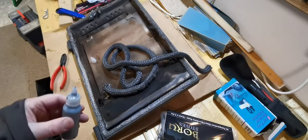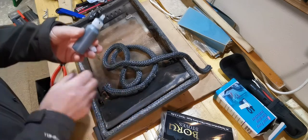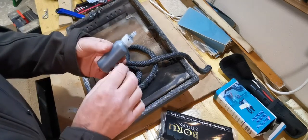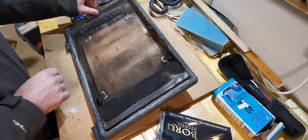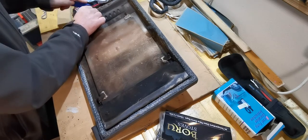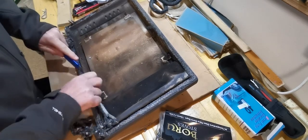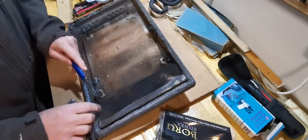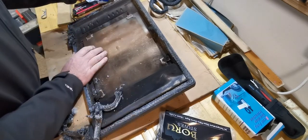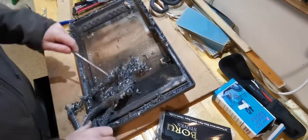Just to say - I opened this glue up, took the top off with the snips there and gave it a shake. It's been lying around for a couple of months, so just wondering how that'll work out. The first thing we have to do is get the old rope out, so I've started here just using a Stanley knife, cutting it out. This is going to be a bit of a job - sometimes it comes out cleanly, sometimes I just have to assist it with the Stanley knife.